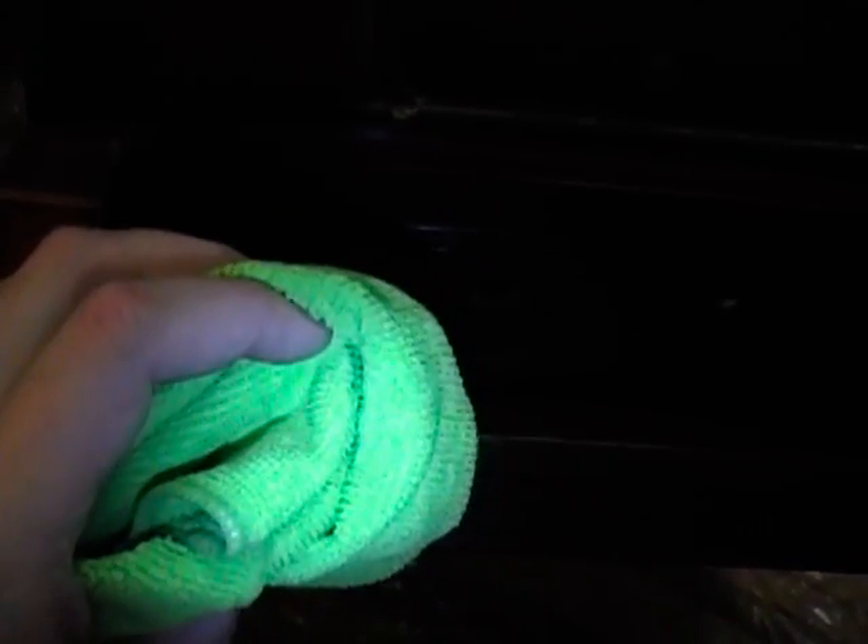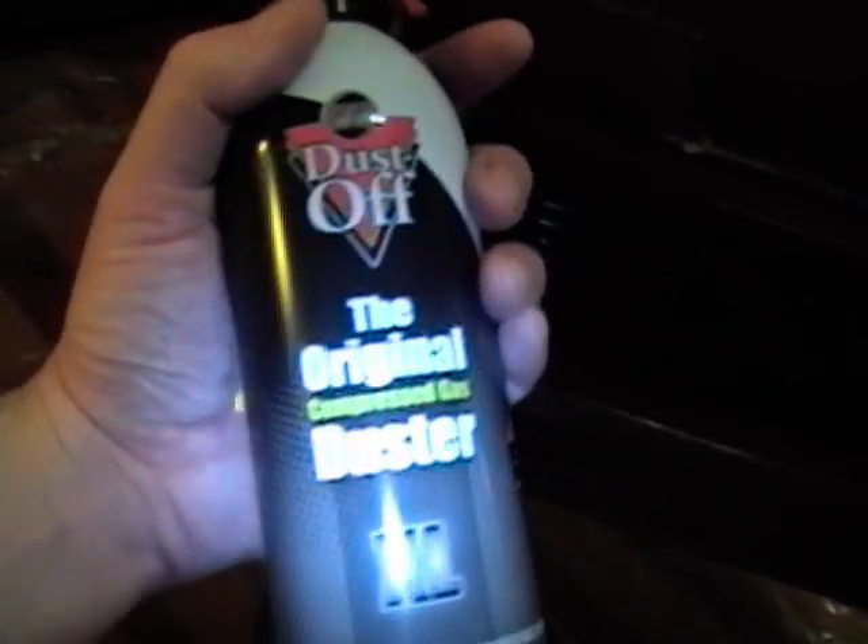What I'm doing now is preparing the surface to spray it with some lacquer. I want to get rid of every last bit of dust and dirt so it doesn't get embedded in the finish. I'm using a microcloth — I like these a lot better than tack cloths. A tack cloth is a piece of cheesecloth impregnated with a gooey rubbery substance that'll pick up dust fine, but sometimes that gooey stuff can leave a residue. Whereas these are washable and they really pick up dust well. I'm also shooting with a little bit of compressed air — they sell these for computers, to clean keyboards and fans. Works great on furniture too.